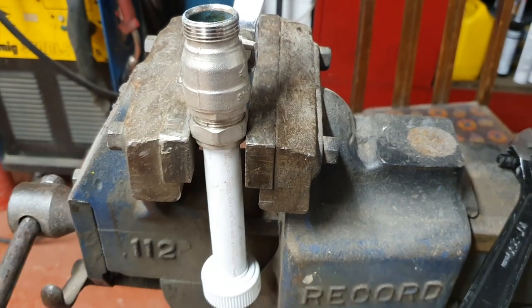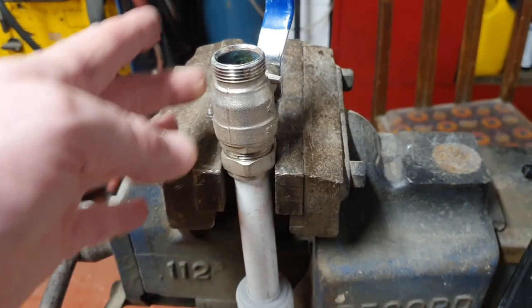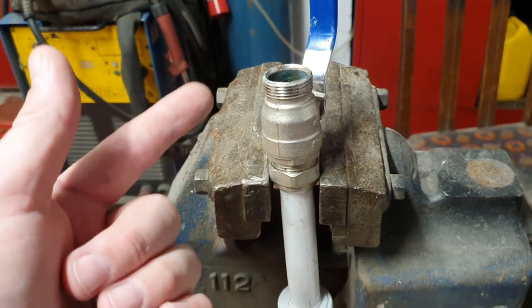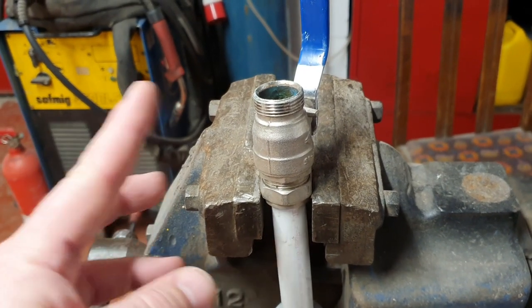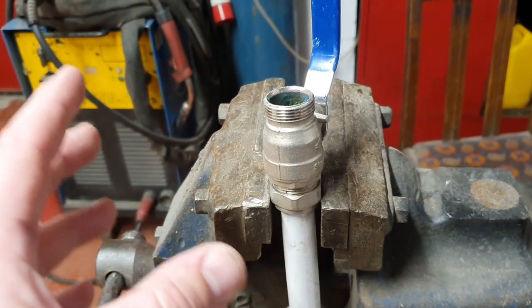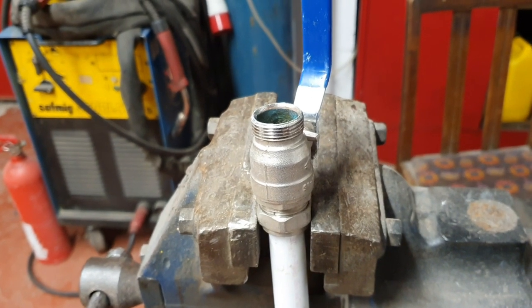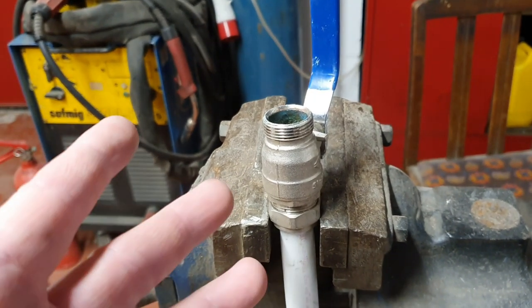And we'll be able to put this straight back in with no other modifications and get another year out of it. Maybe it's worth sourcing a stainless steel one, but for this version of the cask wash that I've got down there, probably not. Simply because I intend to make a fully stainless steel version at some point in the future, but only when we know exactly what we need to do on it. I think I need 4 tanks: rinse, caustic, rinse, acid, and that's probably how it's going to look when I build it. 4 tanks, 4 pumps, 4 everything basically.